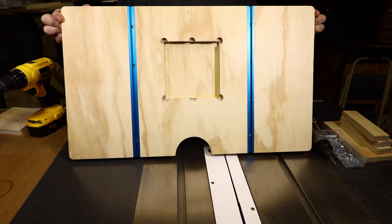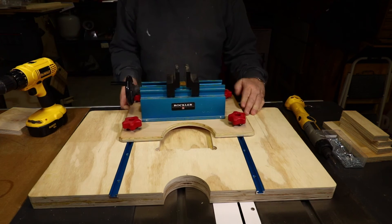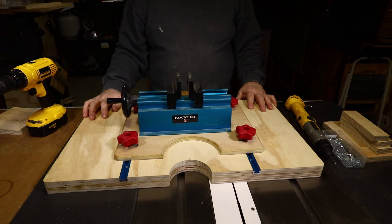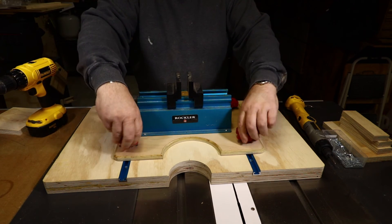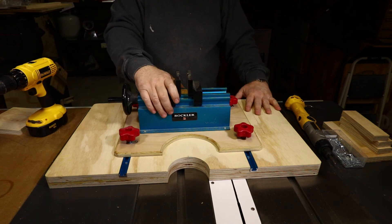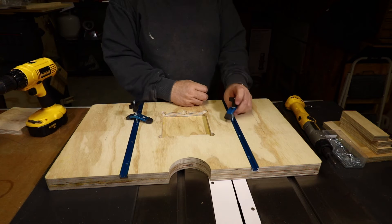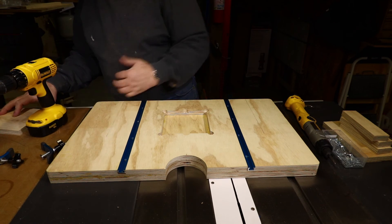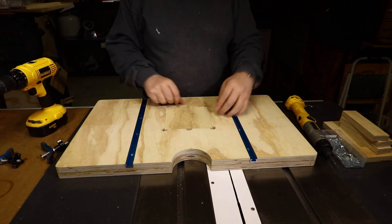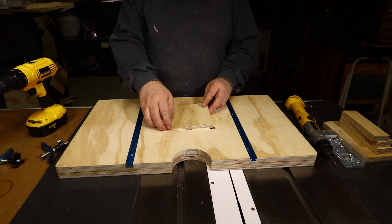So I've got the T-tracks in there. Now I'll be able to more easily fit my jigs on here — get that sized and fitting into the right position I need when I'm drilling these vertical holes, and the knobs will lock in place to hold it solid. I'll also be able to use other kinds of hold-down clamps — these are small ones, I've got some larger ones too. And I've got my insert here for the backer board for drilling — it fits in great, and a couple of finger holes to take it out. I cut up a bunch of these to size so they'll work great.